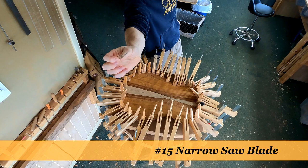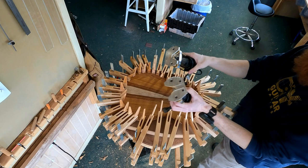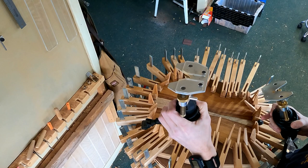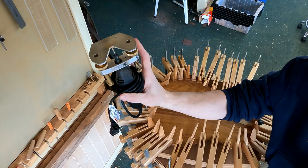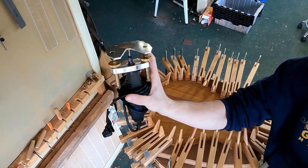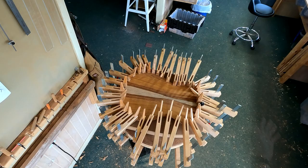For accuracy, try this out — a little keyhole saw, I'm calling it for now. And then I cut my notches. As I've talked about before, I have my two-Dremel system. One Dremel has custom acrylic attachments that let me trim down the height of my brace ends very accurately. The companion Dremel is set to the same height but makes an inverse cut, so I get a perfect fit between my brace ends every time. Repeatability and consistency is a good thing.